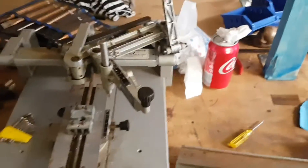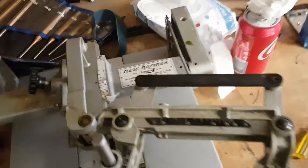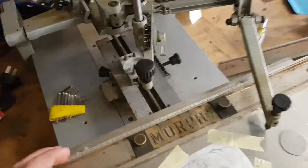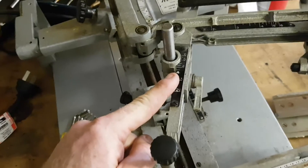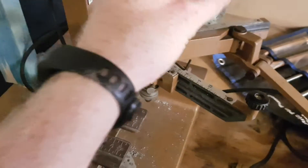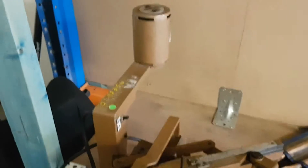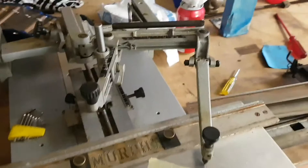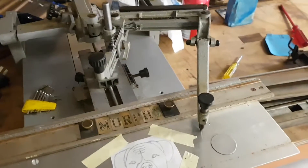This is pretty much a smaller - a tiny version - of that big TX3. This is a Gravograph GK, so it's really old. So these two markers here are your grabbing points. Whether it's the spindle type like this one - see how it rotates? I've got my Allen key in there. She rotates, that's what the motor's for. You have a pulley going from underneath the motor to there and that gives it drive. Then you use all your bits. Getting all the angles right on the cutter is a science in itself, not just a simple grind and off you go - there's more to it than that.